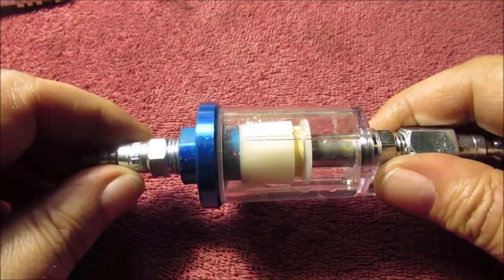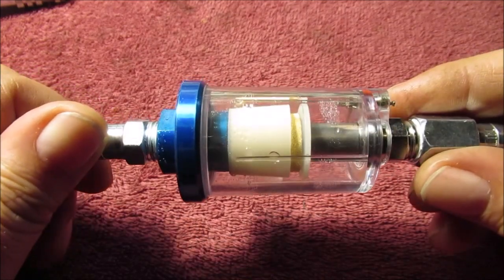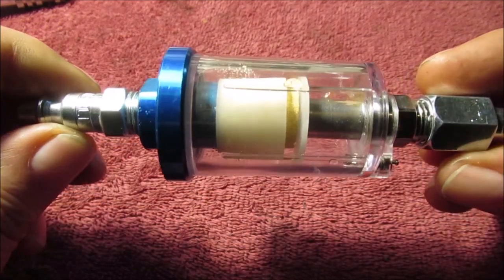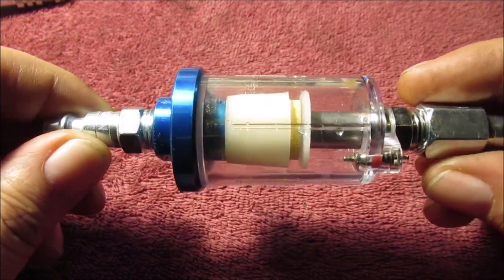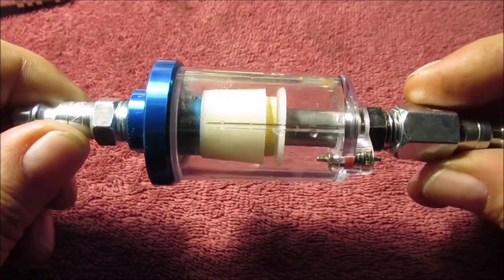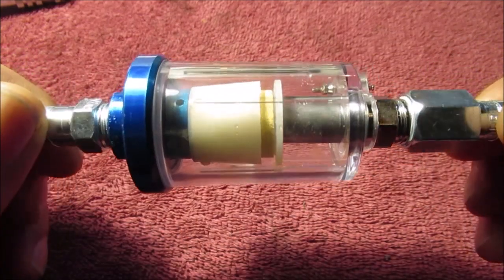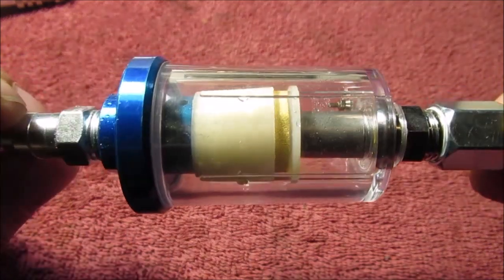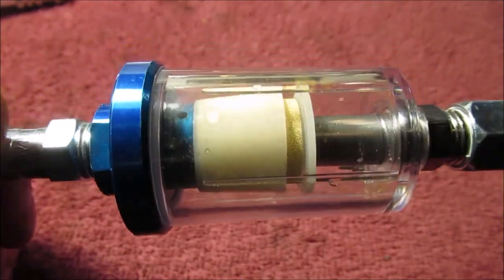The tank has been drier. I mean, the first couple times I filled that tank, I didn't like it. I had moisture coming out of it. The past two or three times using the tank, using this filter, very little moisture comes out of it. Very little. You could probably add one of them little cheapy filters before the spray gun, the disposable ones, and get rid of that last little bit. So, starting to kind of condense back to droplets, bigger droplets now.